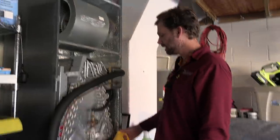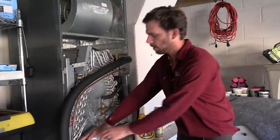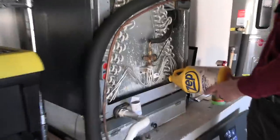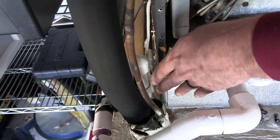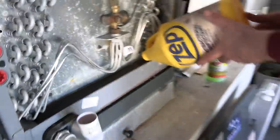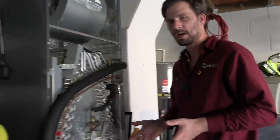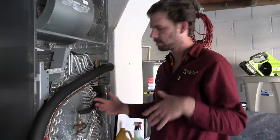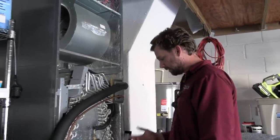As a minimum when I do a maintenance, I'm flushing two gallons of water through my pan, and that will help get that section flushed out. Then I'm going to dump two gallons of water down the service port directly. You can usually get a little bit more force to push stuff through the drain line by dumping through the service port with a funnel. So two gallons in the pan, two gallons in the service port as a minimum. Then I will be checking the vacuum — open the top of the vacuum, look at the water. Is it clean? Is there still chunks in there? If there's chunks, let's keep flushing the drain. If it's clean, then four gallons is fine.